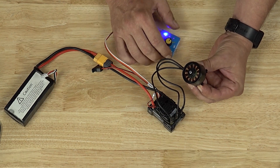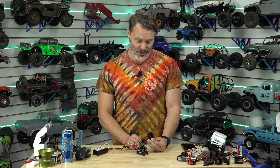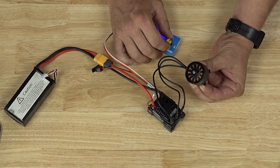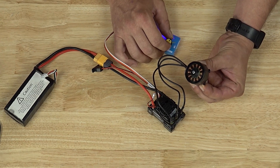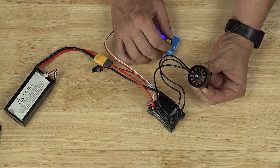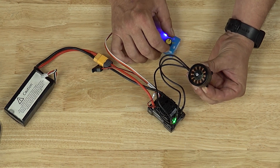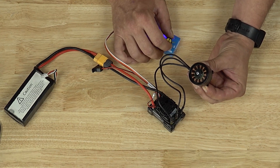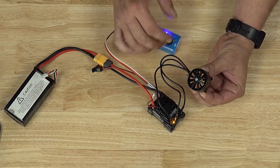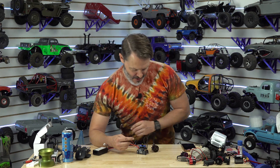It's still going to make noise, but it's not like some of the old ones that were ear-piercing on the bench. We also have what I'd consider active drag — there are a couple of frequencies that start to ring. When I decrease throttle, the RPM comes right down with it, which is nothing new for Castle controllers since the Mamba X — synchronous rectification. There is a little RPM gap; once loaded down you probably won't notice it, but unloaded you can hear there's nothing in between as far as modulation. In a crawler you may notice it; in a basher, you're not going to.